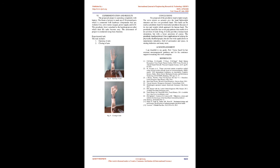The forward and inverse kinematics for the index finger is derived mathematically for the 3 DOF robot finger, and the third-order polynomial trajectory motion is simulated to test the robot kinematics by using MATLAB Simulink. The physical tests show that the hand motion serves concisely for catching objects with a maximum distance range for connection of 37 meters. Also, the simulation results show exact inverse kinematics using the equations derived from the forward kinematics. This robotic hand can be applied in the areas where the intervention of humans may cause danger on their health due to chemical, biological and radiological nature.